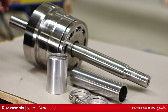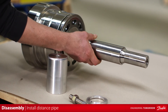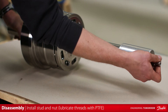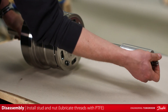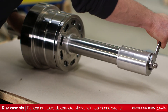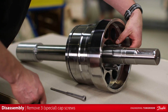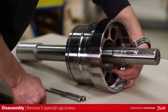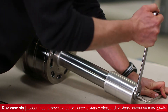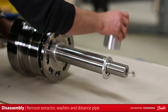Moving on to the motor end barrel valve plate removal. Install the first special tool washer, then the distance pipe, then the second special tool washer, then the extractor sleeve. Install the M16 by 70 stud with M16 nut and thread into the shaft — be sure to lubricate the threads with PTFE. Tighten the nut towards the extractor sleeve with an open end wrench. Remove the three special M6 by 150 locator socket head cap screws from the other side of the barrel. Loosen the M16 nut and remove the extractor sleeve, distance pipe, and washers. This will release the compression spring tension between the barrel and valve plate.